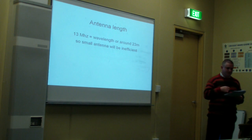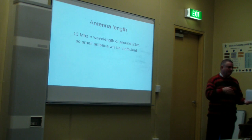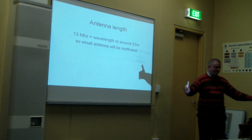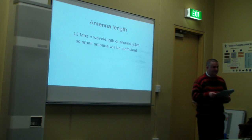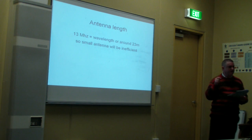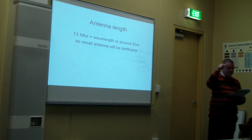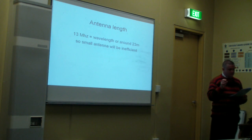So my transmitter worked. What you saw there before was my transmitter on my desk, transmitting about that far, right? But then I ran into a problem. I took my transmitter outside, hooked it up to an antenna, and left it running in my front yard. Now remember, I live in Boronia, which is a stone's throw from Mount Dandenong. I then drove up to the top of Mount Dandenong, which is 3 miles away, line of sight, and then tried to receive the signal. I could only barely receive the signal. So it became apparent that over longer distances, my balloon project just wasn't going to work.